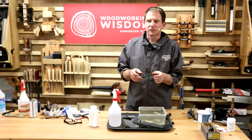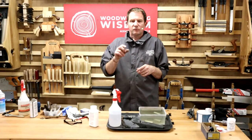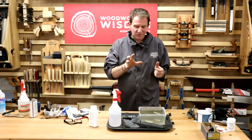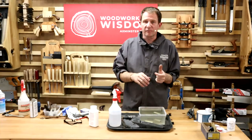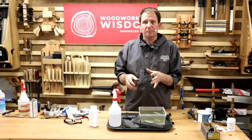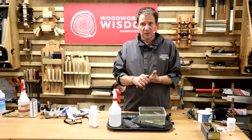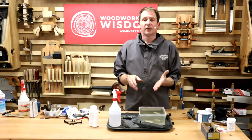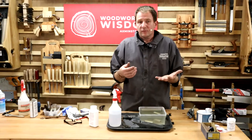Thanks, Craig. All right. So cameras in here, we have to jump on every 20 minutes to make sure they stay on. So okay. So machine wax can be really good for bandsaw tables and everything else. It will help stuff glide. Definitely, if you're using a thicknesser, machine wax on that bed will help stop it rusting, help things glide through that surface. On the thicknesser side, if it helps it glide through, that's great.